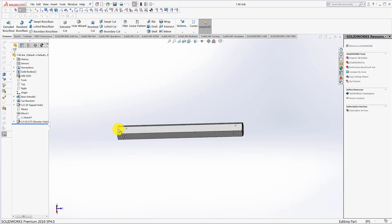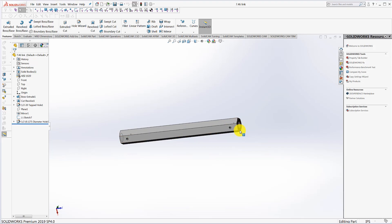You reference that back side in the collet with a stop and do the same thing on the other end. That might be fine, but you have a lot of manual labor there unless you have a robot or something. If you have a large quantity like 200, 300, or 400 of these, it's going to be a lot of labor because it's such a fast cycle time - you're basically going to have to stand at the machine the whole time.